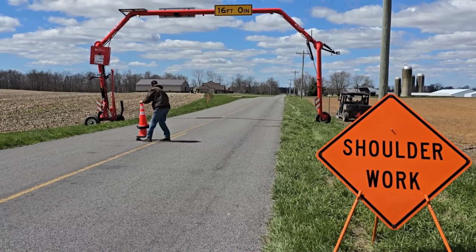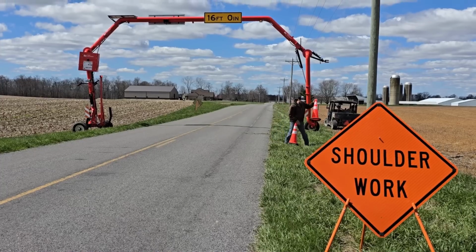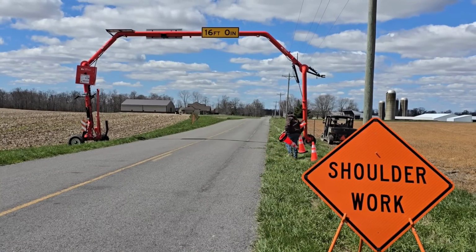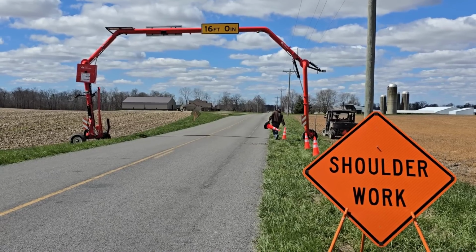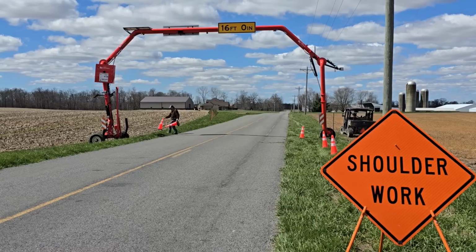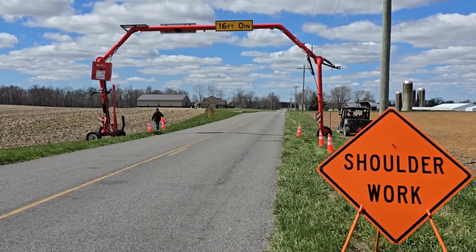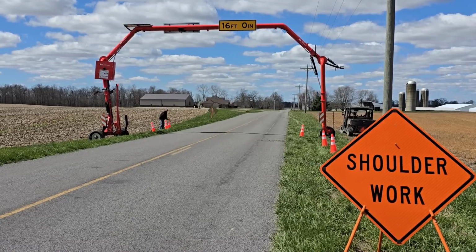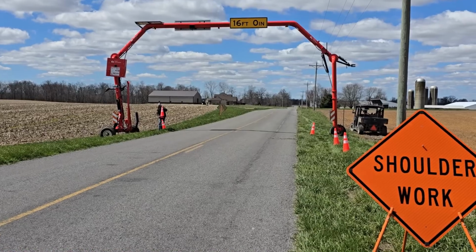The traffic cones should be set up in what they call a shoulder taper. So if anybody happens to get off the side of the road when they're approaching the unit, the reflective bands and the orange cones are supposed to alert people's attention, to guide them back onto the road. So you just set the cones at a little bit of an angle to create a taper.